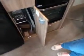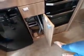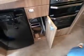In the bottom there are individual gas shut-off valves for each appliance, with a little diagram on the wall to show which is which. Our main advice though — if you ever smell gas, switch it off at the bottles outside. Those valves are more there for a technician if they ever need to remove your cooker or fridge and isolate individual gas appliances.